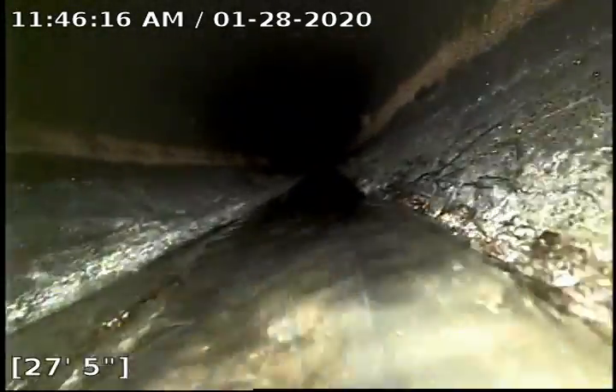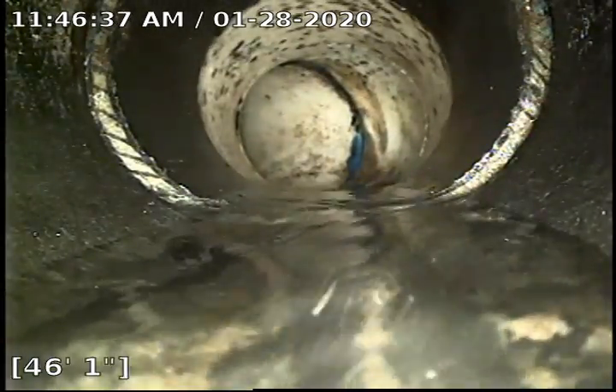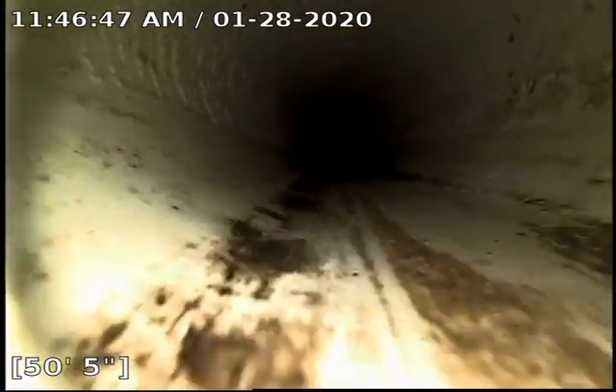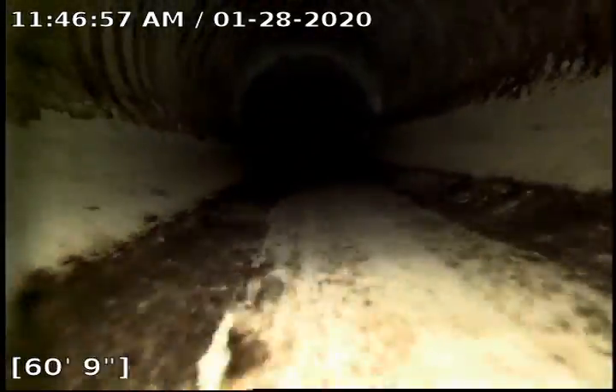We're having some issues with my normal day-to-day camera, so this is a new camera to make sure we record these videos. This line is approximately 95 feet — not 100 like my other camera. As you can see we do have some water running. This is the cleanout under the front deck, transitioning from three-inch ABS pipe to four-inch PVC, making a 45-degree elbow, and running through the front yard towards the driveway. I'm getting it out as quickly as I can and then pulling back.